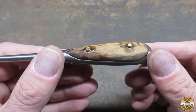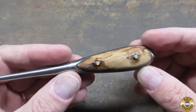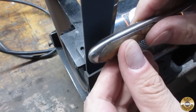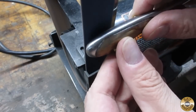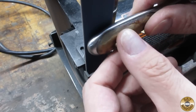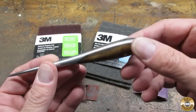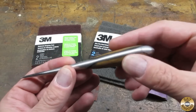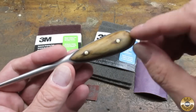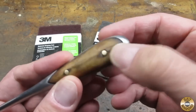Here it is all glued together. I'm going to try to very carefully sand these pins flush with my 1x30, and then hand sand the wood. I sanded the wood down to 320, the metal down to 600, and then I used the maroon and the gray Scotch-Brite. So the metal is ready for polishing, and the wood would be ready for finishing, except I got a little crack right there I want to fill. I'm going to work on that next.